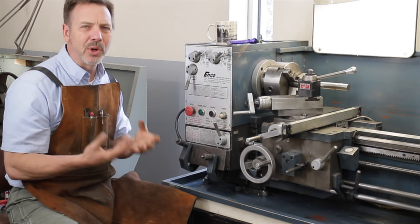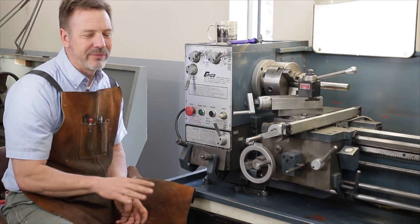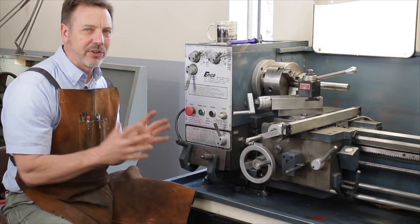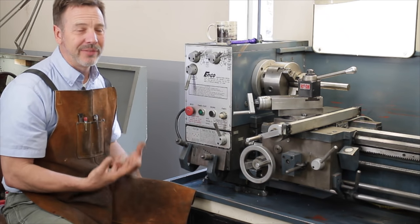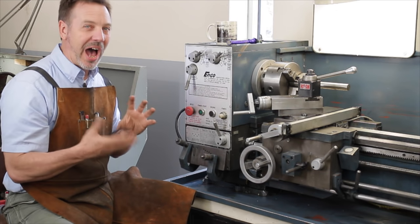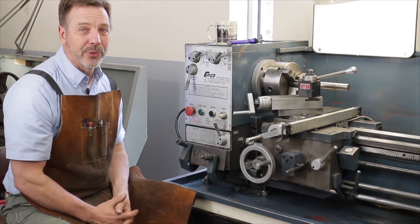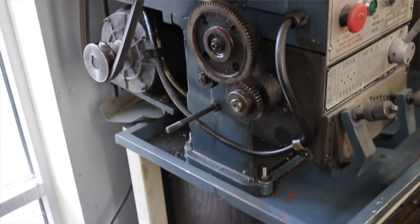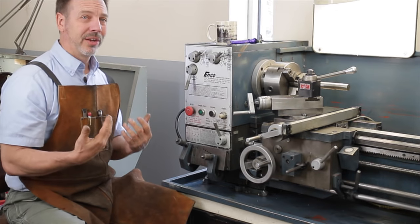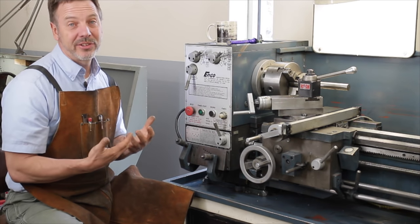There's a motor on this side. Look at it — is it clean or dirty, and what shape is it in? Check the horsepower. A lathe this size should have at least a one-horse motor at minimum; this one is set up for a two. If it had a five-horse motor, I'd be very concerned — that's way too much for this small lathe. The V-belts and the gears and shafting inside are not designed for that. I'd go up to a three-horse and it should be okay.